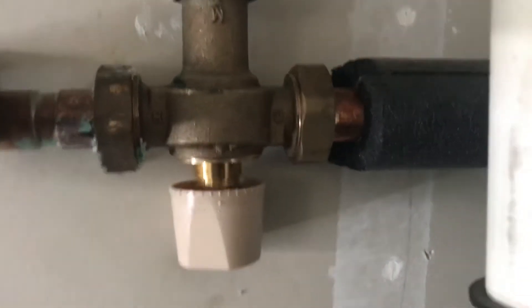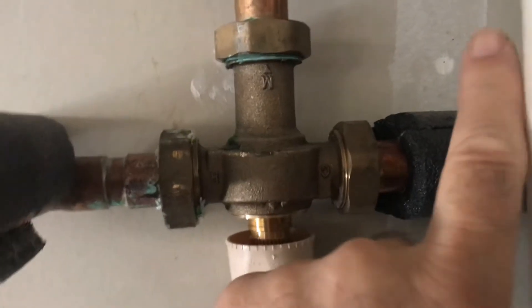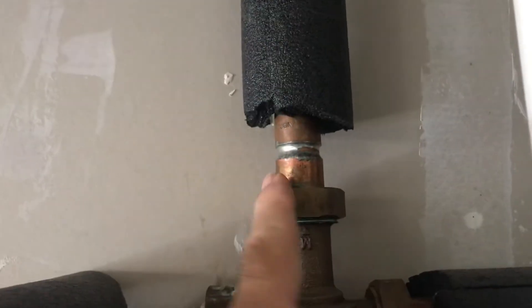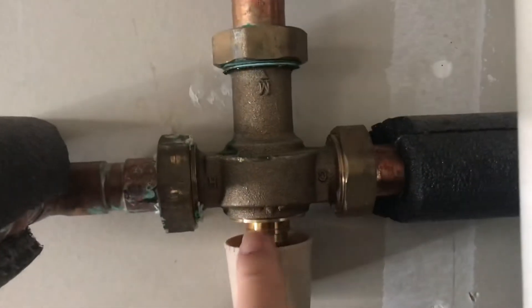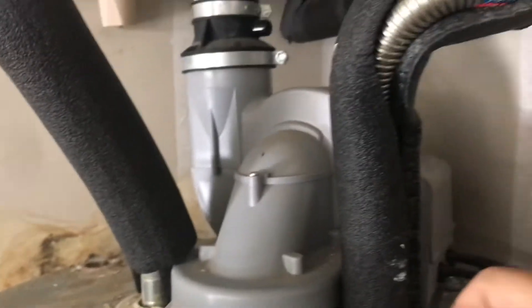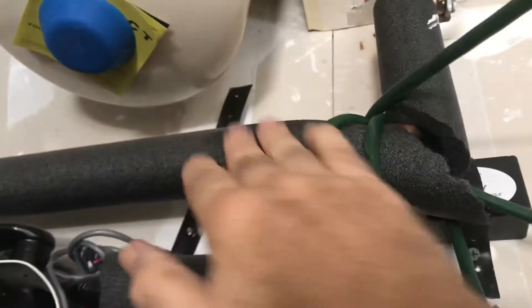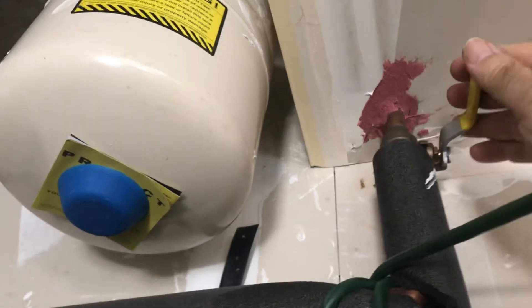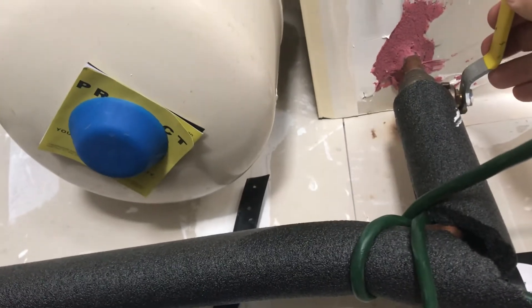This is called a Watts valve — W-A-T-T-S — and if your water is not running completely hot, you've got to check this valve first before you blame your water heater. Check your temperature going into this valve: if it's at 150 or 140 degrees (whatever your tank is set to), and you have cold water coming in on one side and mixed output going to your sinks, shower, and bathtub on the other, this valve needs to be set, cleaned, or replaced — it's about $100. There's also a pump here; with the Apollo system a pipe goes up to the attic heat exchanger on the furnace. I turned that valve off — I just want the hot water tank to give us hot water.